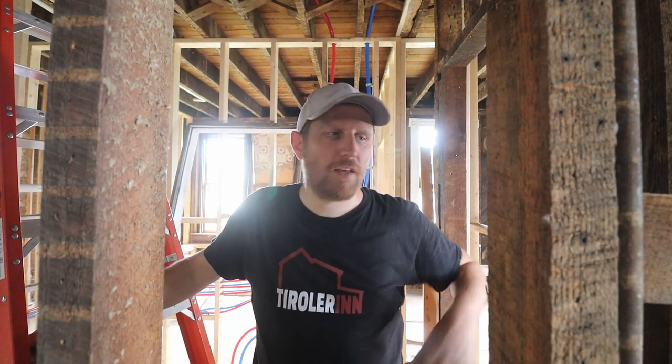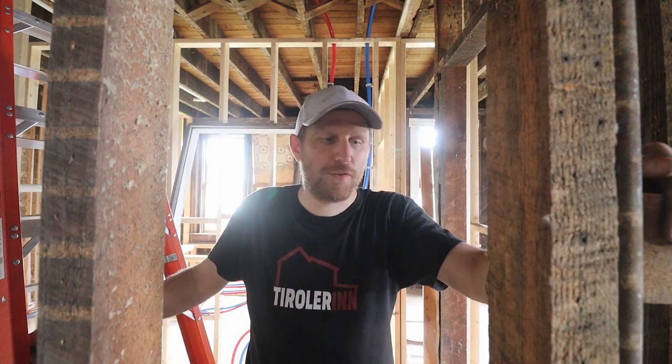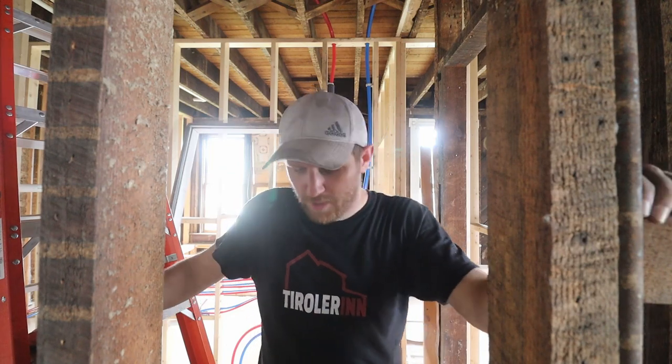Kathy was wondering last week if we are going to do the electrical ourselves after we finish the plumbing, or if we're going to contract that out. Well, we are wanting to do most of that electrical ourselves. The one thing I will definitely have done is we will probably put a sub panel on each floor so you don't have to walk all the way into the basement when a breaker goes out. To connect the sub panel to the main panel, I think I'll have an electrician do that because it's a little bit more complicated.